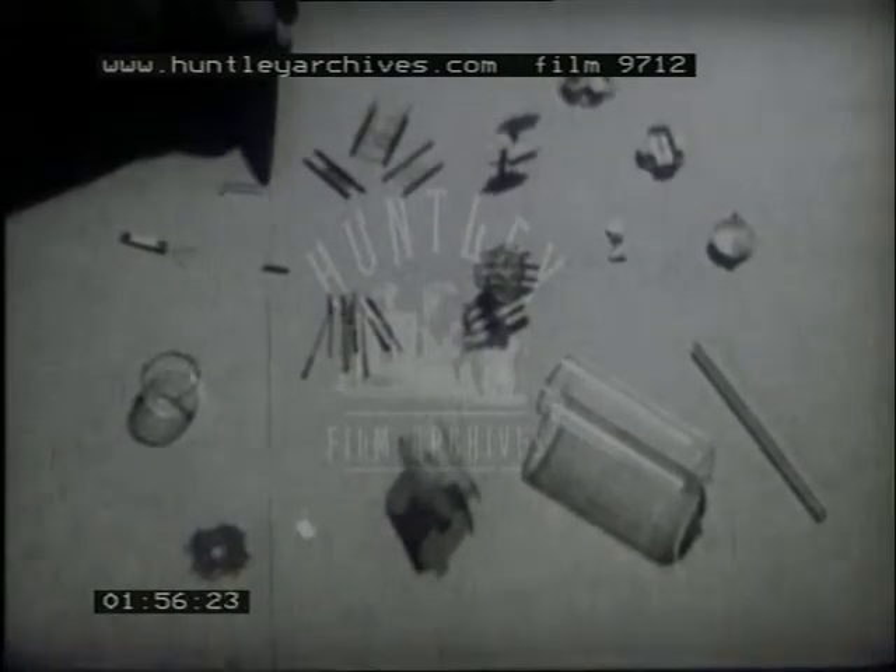Here is the heater: spiralized tungsten wire, only 70 microns or a little over 1/500th of an inch in diameter. It is bent into a V-shape, and is coated with an insulating layer of alumina.